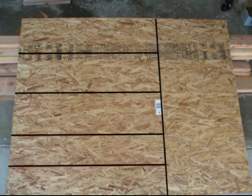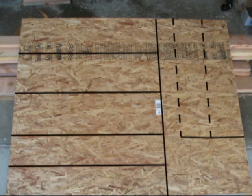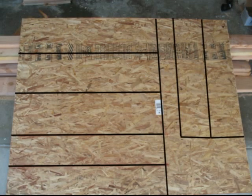If you are going to cut a couple of extra risers, the risers are not structurally as important as the stair treads, so you don't need to waste the OSB or plywood. You can see that we have three treads at the top left, two risers at the bottom, and then two additional risers cut on the right. Remember, the risers can be cut in either direction, but the stair treads cannot. If you have any questions, feel free to leave them in the comment area and I will try to clarify further.